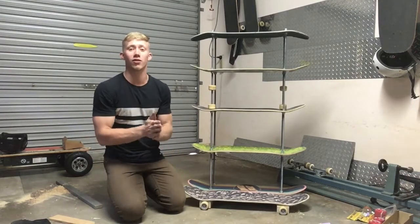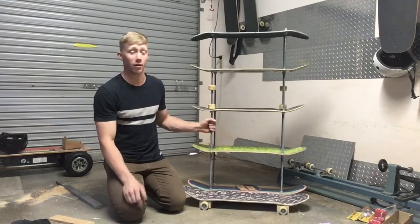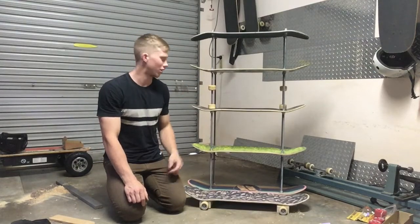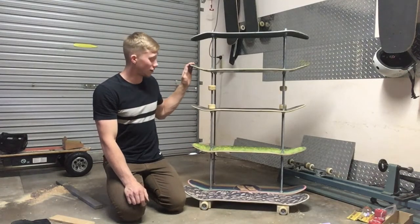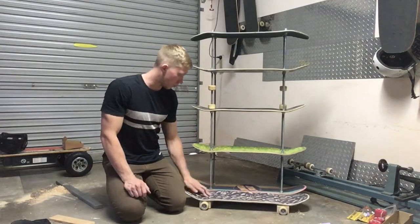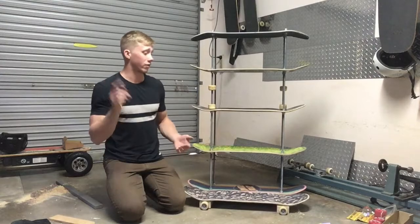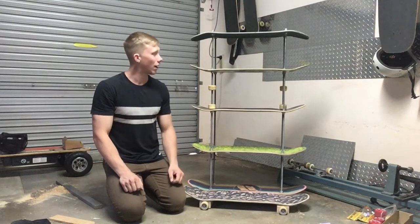Thanks for watching. Just a quick refresher on the hardware and materials I used. There are four 12 millimeter thick, 1.2 meter high threaded rods, about 40 nuts and washers in total. I think I've been calling these bolts, but anyway, they're 40 steel nuts and 40 steel washers, four on either side, top and bottom. And then I also used a couple of screws on my deck here, a length of timber on the bottom, and then obviously drill bits, a drill, and a saw or whatever you want to use to cut your material.